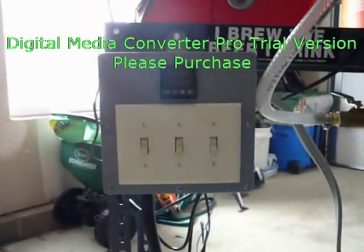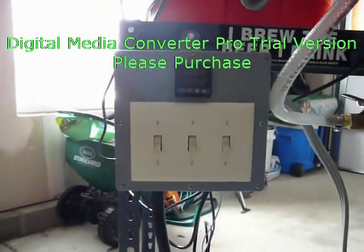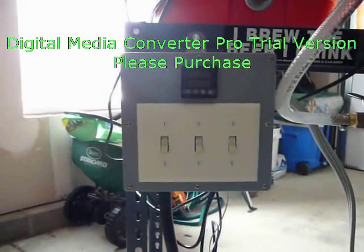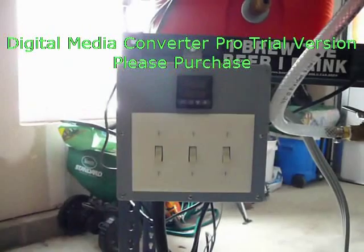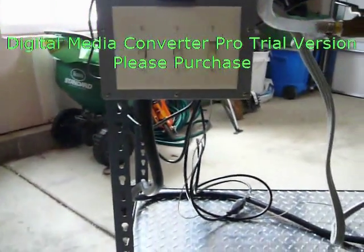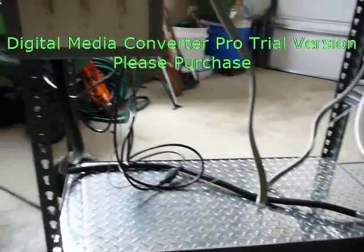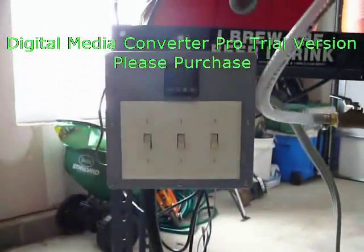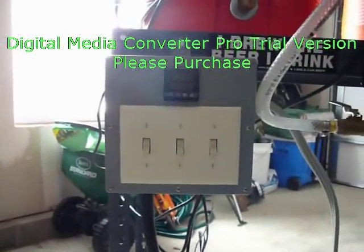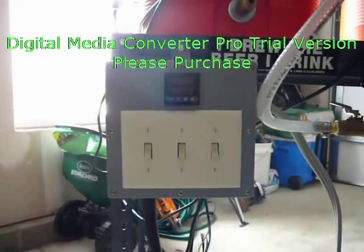And here's the latest upgrade to the system. It's a 240 volt AC control panel. It's fed by a 30 amp GFCI outlet in the breaker box in the garage here. Using probably a bigger cord than I needed to, but this is a 50 amp 4-prong range cord that feeds it. It goes inside to a distribution block, so we can split up hots and the neutral. It's got a separate grounding bar inside.